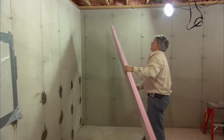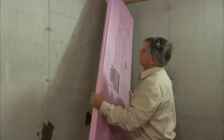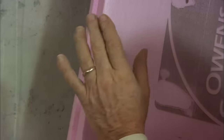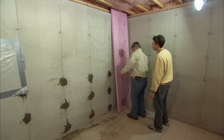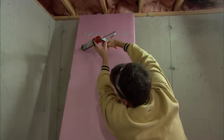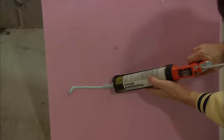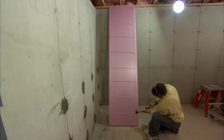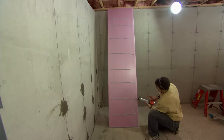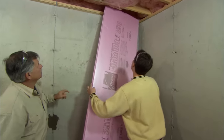This is what we're going to insulate your foundation with — a two-foot wide by eight-foot high by two-inch thick sheet of polystyrene with a tongue and groove joint, so the pieces fit nice and tight. We're applying it to your foundation with a foam board adhesive specifically formulated for this application. It's very important that you don't use an adhesive with a solvent in it, because the solvent would actually deteriorate and eat the foam.